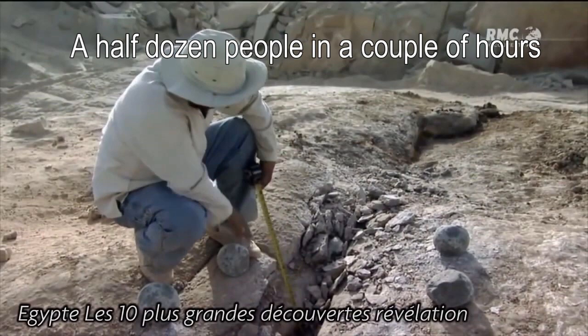With other grinding experiments I've conducted myself, you get the block rough and then grind away to get the smooth, flat surface. You're talking hours, not days, not weeks, not years to flatten a surface. It is just stone — just granite. Get a couple of pieces of granite and rub them against one another over a piece of paper for 20 minutes and see how much material comes off.